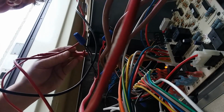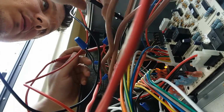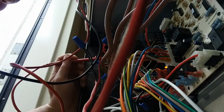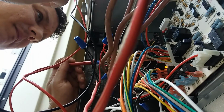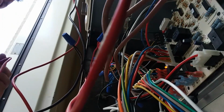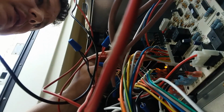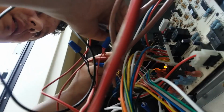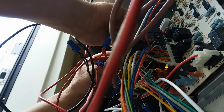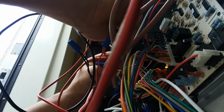I don't have my... That's why I like my glasses, guys. So let's see. Well, what the hell? Hold on. Where'd they hook? Oh, okay. So we got a SS1. That's throwing me off. I was like, where's the red wire? There we go. So that's going from the SS1, so it kills the 24 volt totally. And blue's common. 28.2 volts, guys. 28.2.